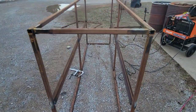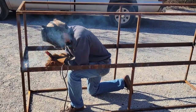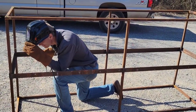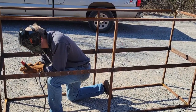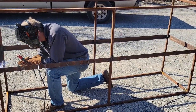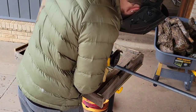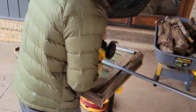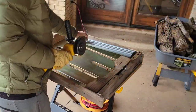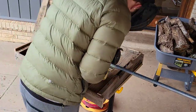Actually it was my dad who did the welding for this part. A note on the measurement for the width of this worm bin: I did it a little bit larger than two feet. I wish I would have done it closer to two feet, because thinking about how you cut the conduit later — it comes in 10-foot sections — since I was a little bit wider than two feet, my sections were longer than two feet, so I had scrap metal. I could only get four pieces of cross conduit instead of the five you should get out of a 10-foot piece.